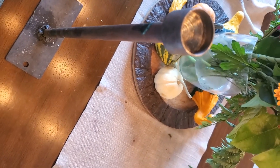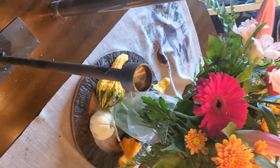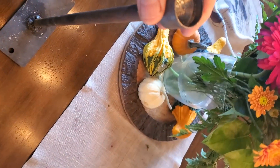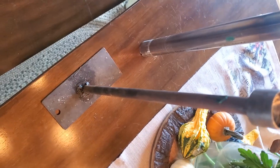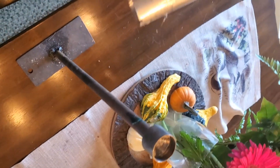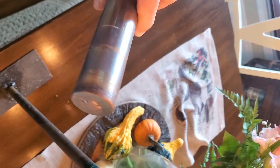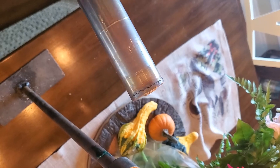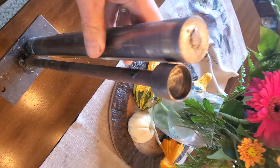You could put the gold in here and flame this off, but the mercury vapors are going to travel up through the air. When they travel up through the air, you're always worried about breathing in the vapors — it's extremely toxic. So the easiest way to do this is to do it correctly. The gold amalgamation with mercury goes in the crucible, and this is nothing more than a piece of stainless tube that I had laying around. I just capped it off, welded it, and made it slightly taller than the actual crucible.